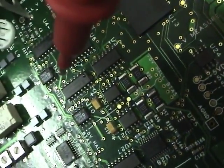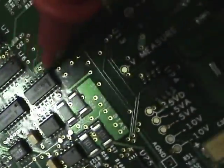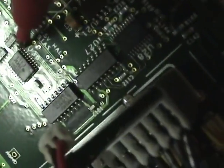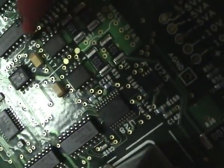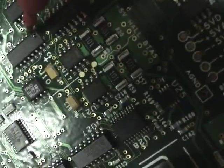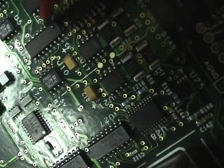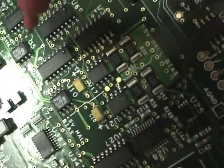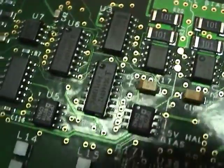You can quickly sweep it across. If I connect it right on the other end, you can sweep it across chips quickly and figure out where it's actually connected. With a fast continuity beep, you can sweep it very quickly and immediately find where it's connected. It's connected to a few around here. I think one of them is right near 0 ohms, so that's the one that's actually connected. I think that was this one right here. So this chip, if enough current flowed through that resistor to blow it, it's quite likely it blew this chip.